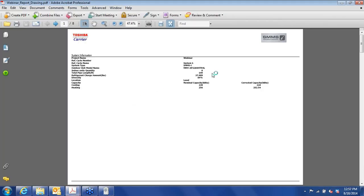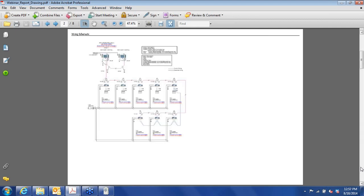The report drawing, it's actually pretty useful. This is a page for the total of the two systems. Wait, I'm sorry, no, this is for system one here. So we have to add 37 plus pounds of refrigerant to this system, and that's for two reasons. Equipment like these outdoor units can only be shipped with a maximum of about 25 pounds overseas. We have to top off the outdoor unit, that's about 20 to 25 pounds right there, and then you have to add for the liquid line and the volume of the evaporator coils on the indoor units. So 37, almost 38 pounds there.